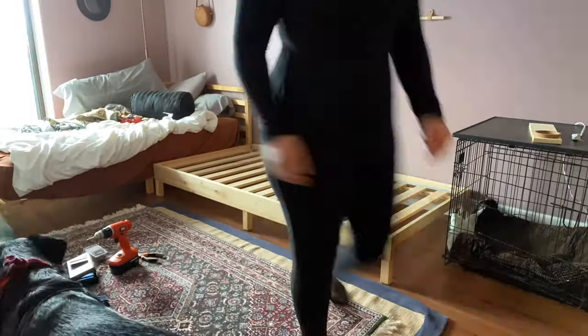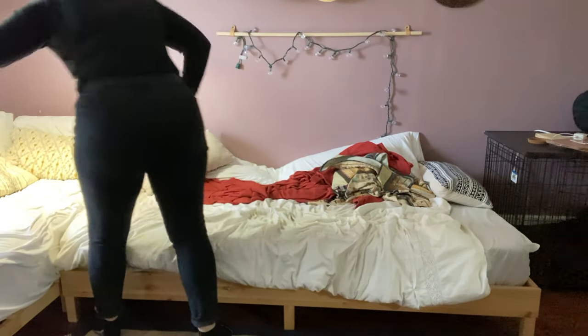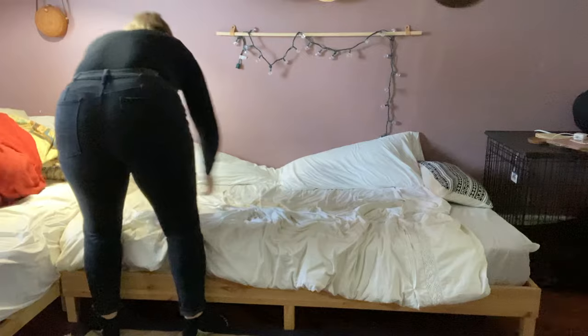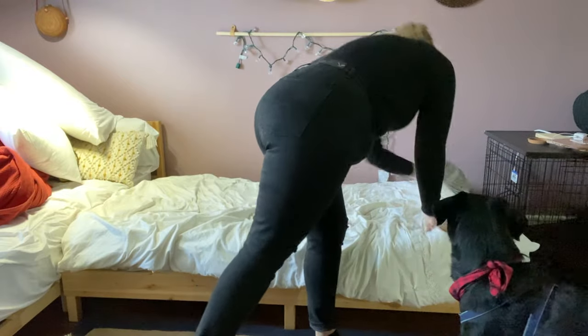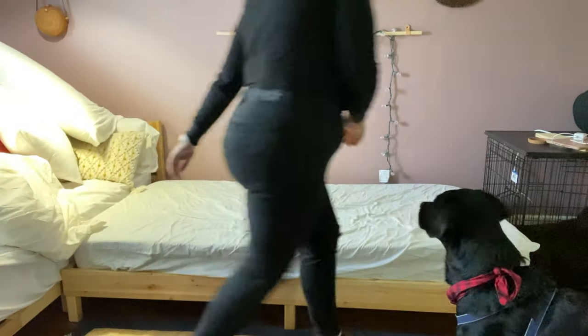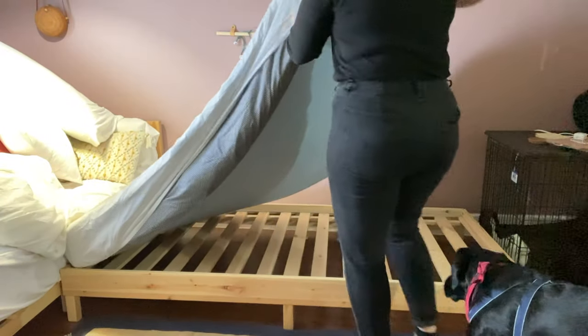When we first turned the bed around, we realized that it needed a little bit more support in the center. As this frame was not intended to support itself, I figured we should put a brace down the center. For this, we used a 5-inch by 72-inch board, 1 inch thick, and screwed it to the wood slats on the top. I also added another foot in the center, but this is not needed.